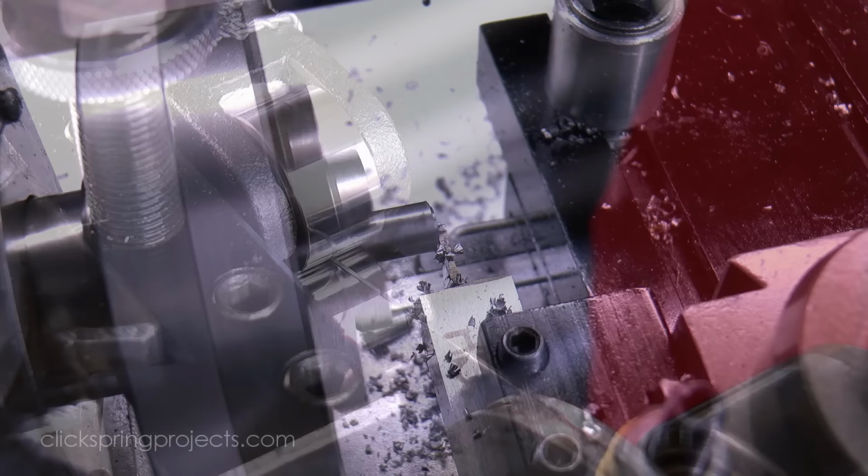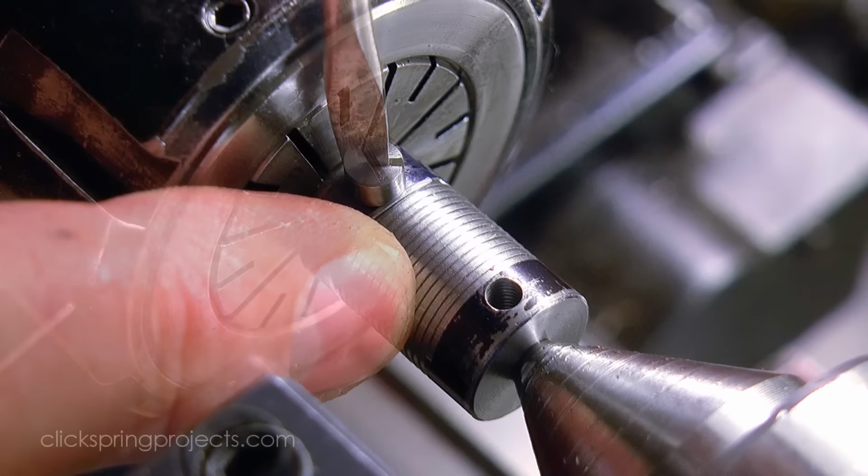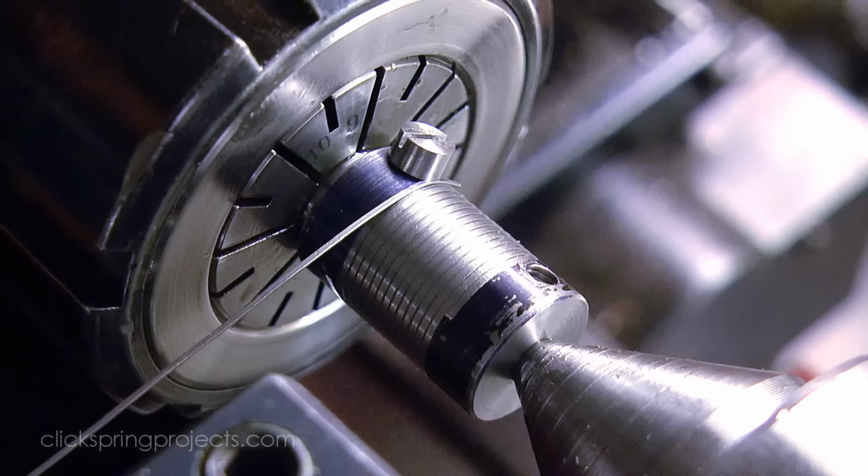One thing worth mentioning is that the fasteners at each end of the helical former are required to be left-hand thread to make sure that the spring material is under a light tension on the former as the fasteners are closed down.